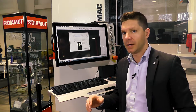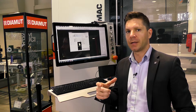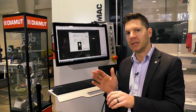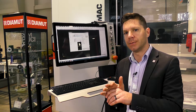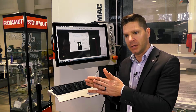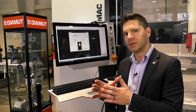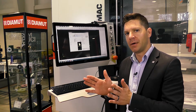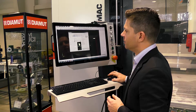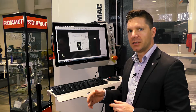At position six you have the option to set it up as a diamond which goes point to point. However, on an Intermac machine you have the option to set it up as a polisher. What that means is the machine will read the adaptive thrust, or amp draw, on the machine. The tool comes into contact with the material, evaluates its diameter, and as the diameter reduces it comes in more, maintaining constant pressure from start to finish. If you leave it set as a diamond, you'd have to manually adjust it on the fly.